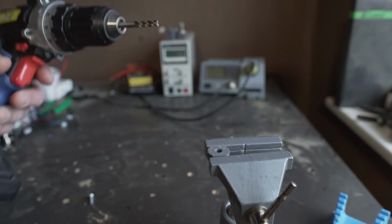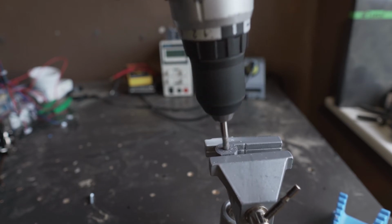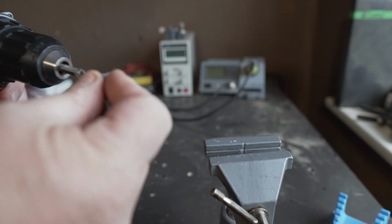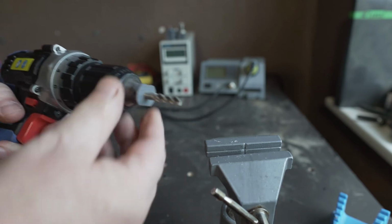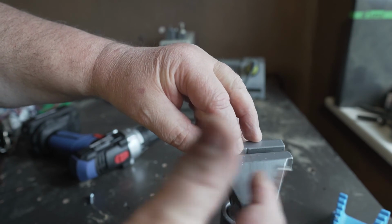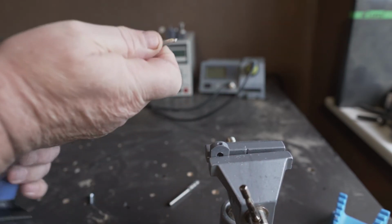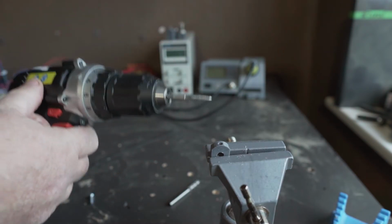As a matter of fact, I started out drilling the hole to fit the bit, but I didn't do that because it had to be accurate in the center and at the right angle, and sometimes it failed. So I decided to find out how much I need to oversize the hole so it fits exactly to the bit, and that I have done. So that part is not actual anymore, but I do make 4 millimeters of threads, and I do that on both sides.